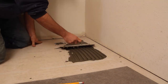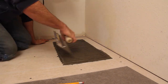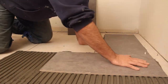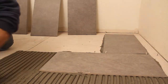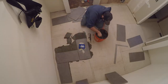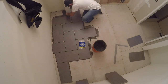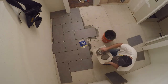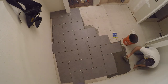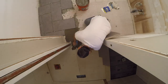Once I was sure where to start, I plopped down the mortar for the first tile and set it in place. To get the best results, I pulled the notched lines in one direction and then rocked the tile back and forth in the other — this collapses all the lines down and gives the best possible connection. I continued adding thinset and smashing down the tiles. Since these tiles at 12 by 24 inches were pretty big, I used a wide 3/8-inch spacing. I took the process slow and methodically, but the hardest part was just getting the pattern right.